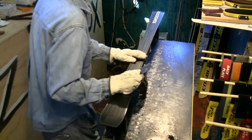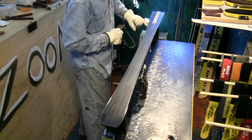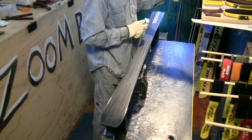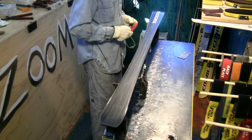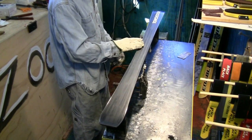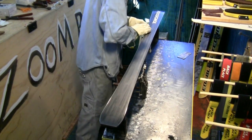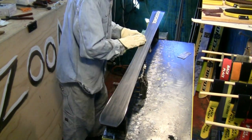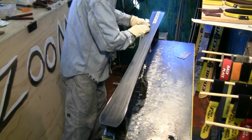One thing, you're coming down and hitting the edge again. The other thing it means is that the interface between the plastic and the edge itself still has some microburrs there, in which case you're better off taking a wet diamond stone and doing this. But this is an old one, and I'll just show you dry. I'd take this diamond stone, hold it flat on the base, and run it up and down, with some fluid, like you see me using. You're not trying to make a bevel now, you're just holding it flat.